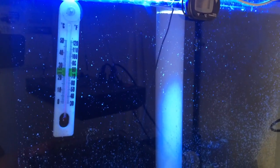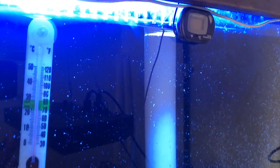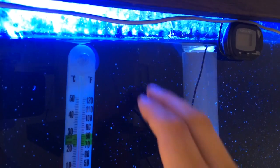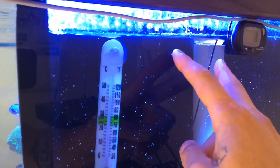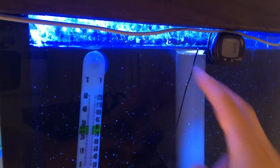Now the advantages of the Herbie method are that you have two drains. If one gets clogged, it automatically turns into basically a standpipe — not a Durso standpipe, but you could have a Durso if you wanted on the top of this, and it would be the exact same thing. The entire reason you don't plumb in the Durso on there is because if the main drain does fail, you want to be able to hear the water going down into this emergency standpipe so you can correct the problem with the main drain.